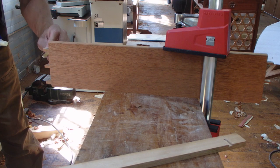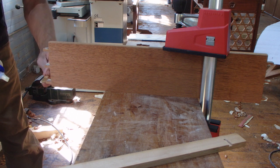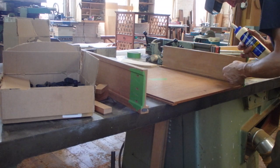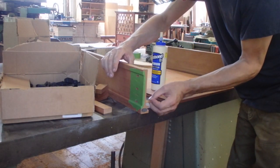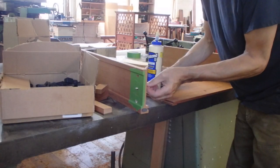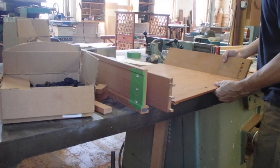There are two drawers on the inside of this cabinet, and these represent the Mark III version of this form of drawer construction, which I derived from Scandinavian practice. The main difference with this cabinet is the drawer sides and runners were previously made of two-piece construction using a sliding hammerhead joint, now are milled out of billet, so to speak. I.e. the runner and the side are one piece. I think this makes for a stronger drawer, but more importantly, it allows the drawer sidewall to be pushed outwards relative to the runner, thus increasing interior drawer volume.